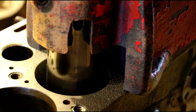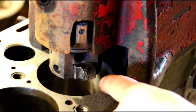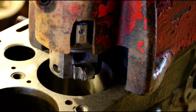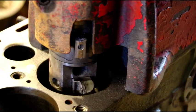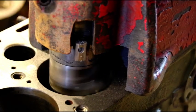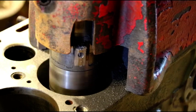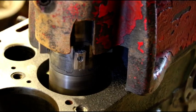We did not clean up at 3.197 inches — there's an area that didn't clean up. I've now switched out to my 3.202 cutter and we're going to send that down. I still have three thousandths left for the honing machine, but I like to be fully cleaned up with the boring bar first. Sounds like a better cut — sounds like we're getting it all the way around. If we get this cylinder, number four is going to clean up too.